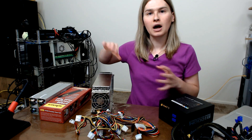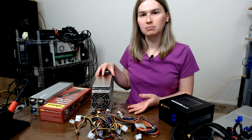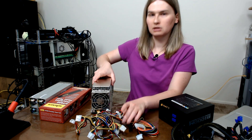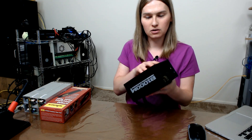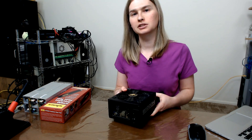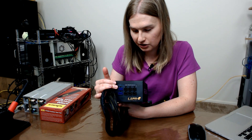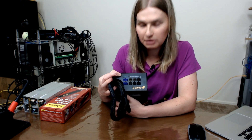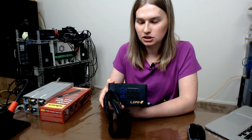I want to make sure that I'm not overloading power, especially on the 12 volt lines coming from my replacement PSU. So this is my replacement PSU — this is a Lepa B1000M and this is an older power supply that I've had. It was originally on my external mining rig but not anymore. I was looking at it and I noticed the number of lines coming out of this box is great. It's got so many wires coming out of it, so whatever this JBOD is going to pull when the discs start up — which is going to be quite a few amps — this thing should be able to handle it.